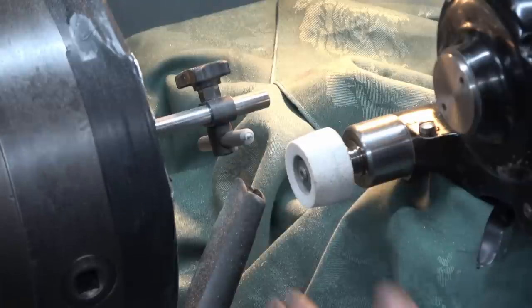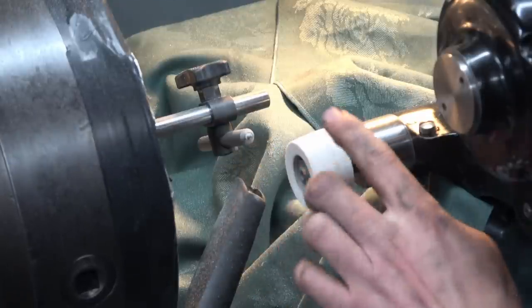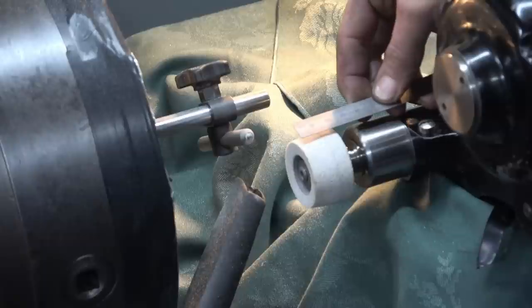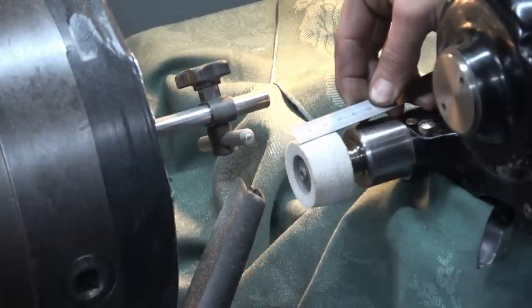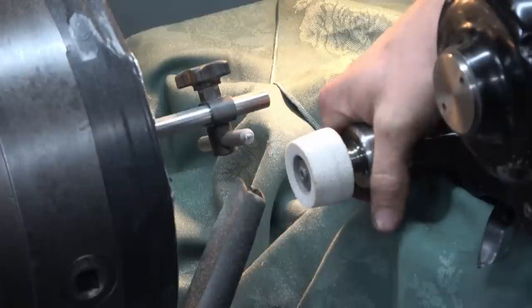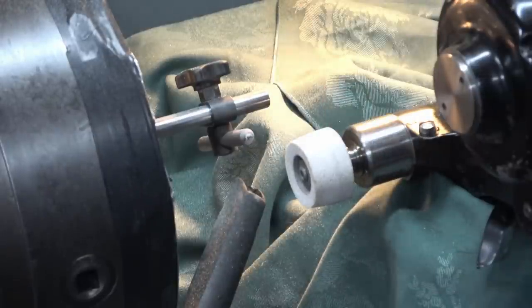Successful. I've got my face prepared for end face work. The angle is 7.125 degrees on there, if everything's worked out right, and the workable length of 15mm, which should be just enough. Bearings don't seem warm — that's okay. On to grinding.